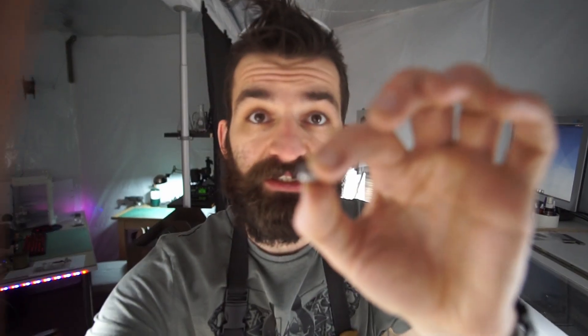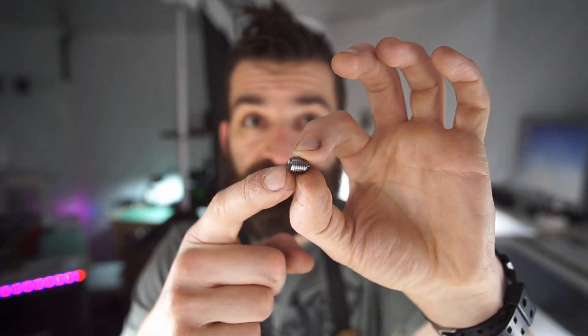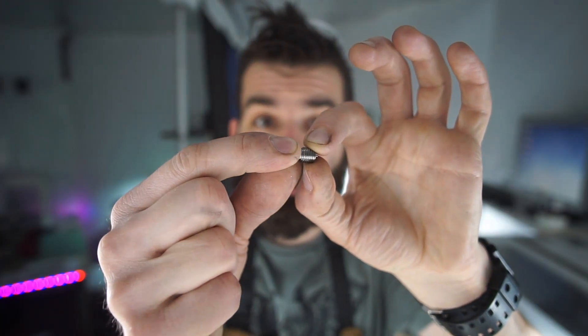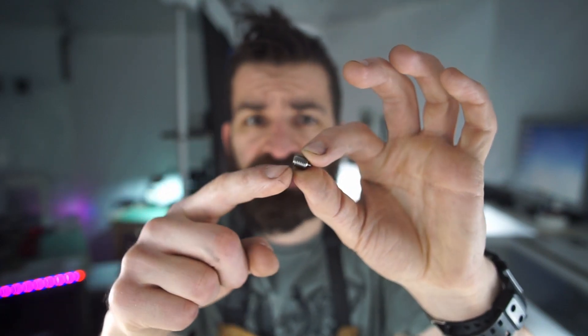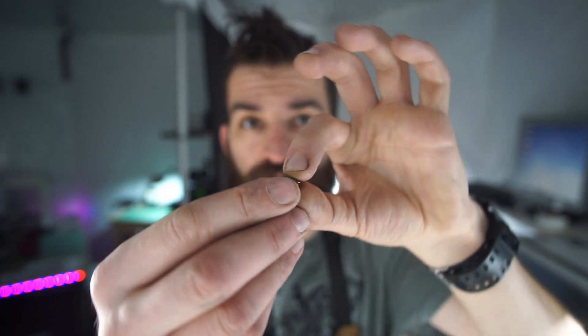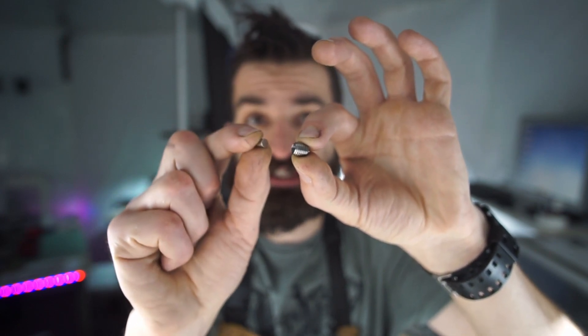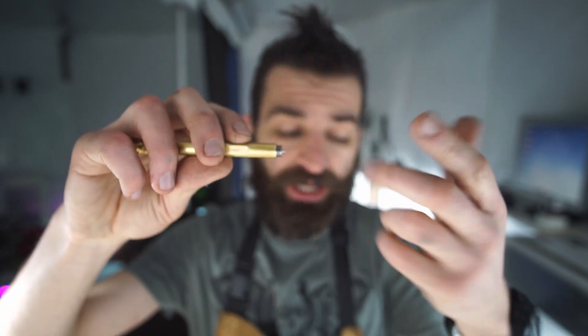A little pip is still on it because I haven't put the drive in the back end yet. You can see this is all titanium, and titanium isn't magnetic. So we bored a little hole — I had these magnets that took me a little while to source. They are 5mm diameter magnets, which are weirdly in-between sizing. What that's going to do: once the hole is drilled — I over-drilled this because I didn't have the correct size drill — I'm going to ream it to the exact size of this magnet, so it'll be a press fit in place, and that's on the inside of the cap.